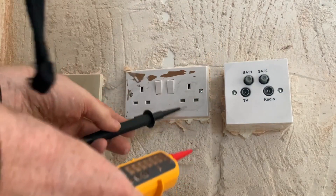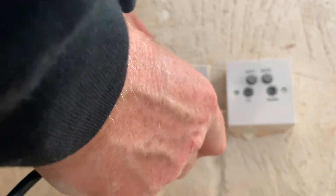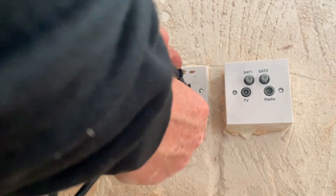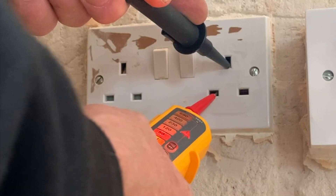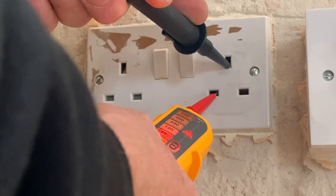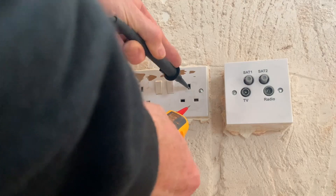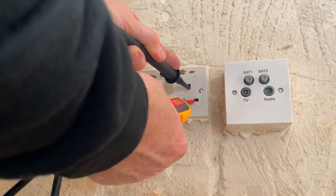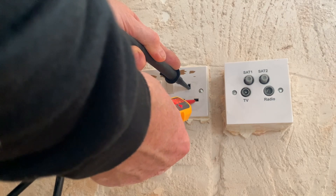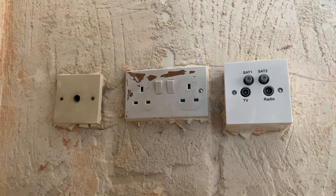Let's see what voltage we've got going down here. Using this to open the gate on the earth — we've got 50 volts between earth and neutral, where we should have nothing. We're getting all kinds of readings — let's get a multimeter and check that.